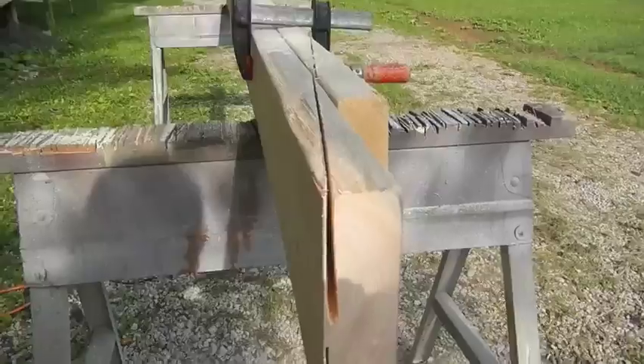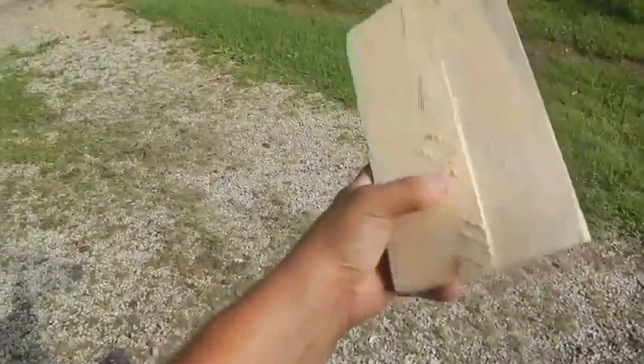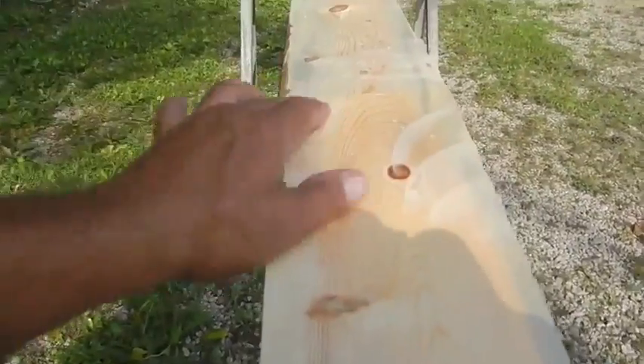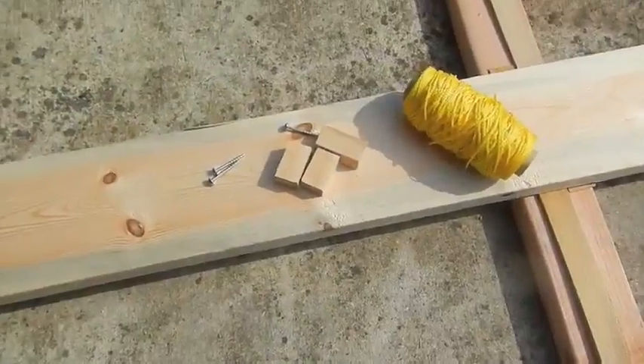Follow-up — got it pretty close. I'll cut it all out. Scarf finished, and it wasn't real clean — kind of goofy actually. I cut it with a handsaw so it left a center ridge on the other pieces. Cleaned up enough. I might work on this one a little more. That's my dream tool for boat building — 24-grit on a grinder makes this job about 15 seconds. This is going to be my straight gauge to make sure my keelson's straight — pretty simple: three blocks all from the same piece, a couple screws, and some string.